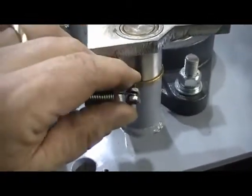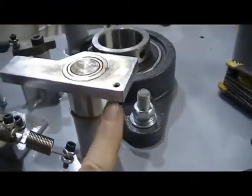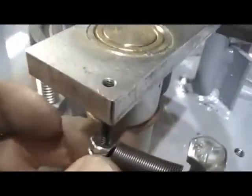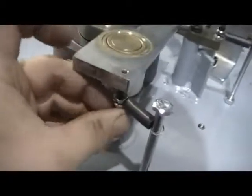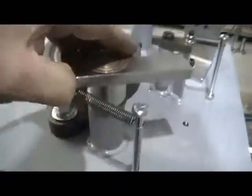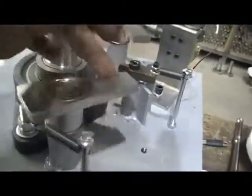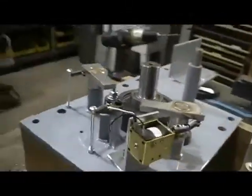Now I have to flip this guy so he is literally upside down going into the bottom of here. Okay, so I got that assembly together, and then screw that in. You don't have to do it on the pawl, you can take it off once you've got it set in, and then use the Allen wrench, of course, to finish it off. Okay, so now that part's all together. So that mechanical locking is what does that action against the ratcheting. So we've got both of them, we've got a complete reversal now.